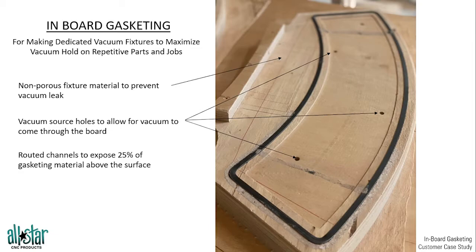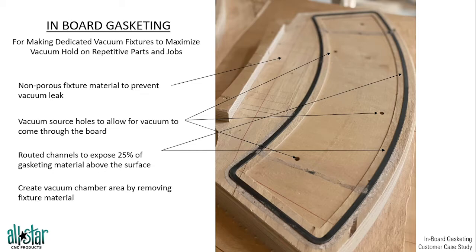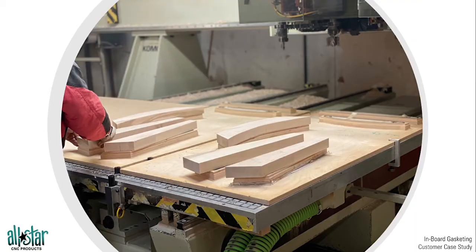After drilling the vacuum holes, we seal it by creating a gasket channel — burying that gasket three-quarters of the way in and leaving 25% above the surface. That lip above is what creates the seal around the part, and that seal is what creates the vacuum clamping ability. We also need to create a vacuum chamber to allow that vacuum to be pulled out of an area — we can do a trough or a grid system, any system that creates an area from which we can pull the vacuum.